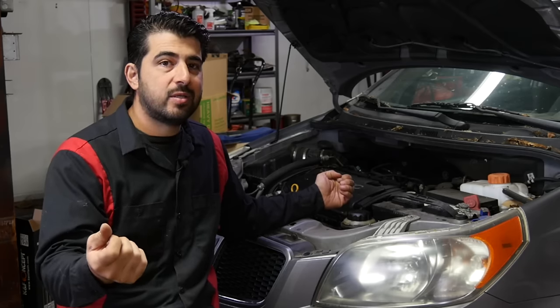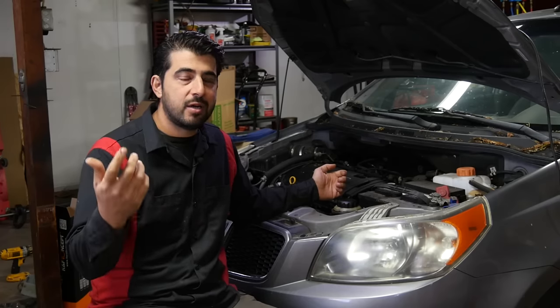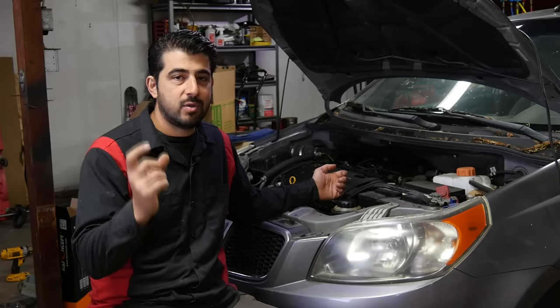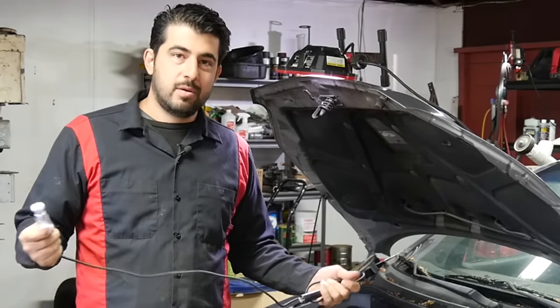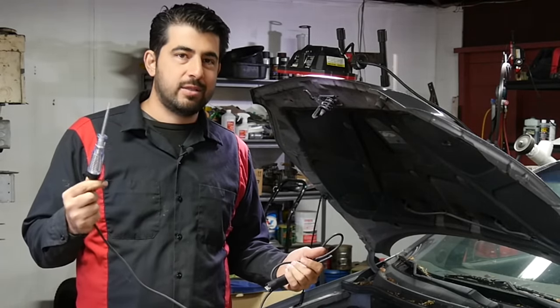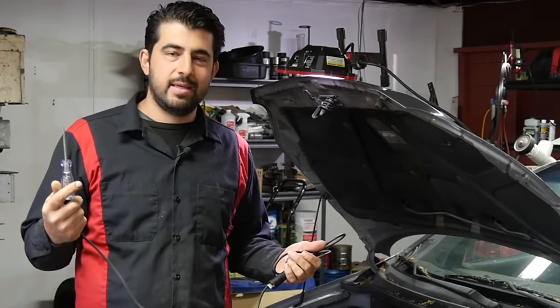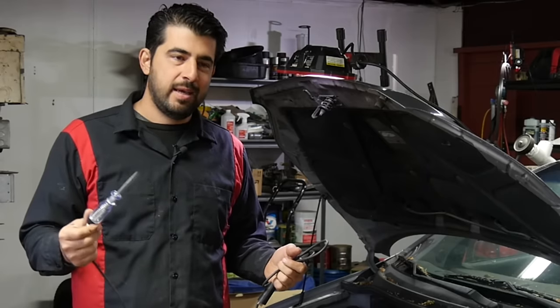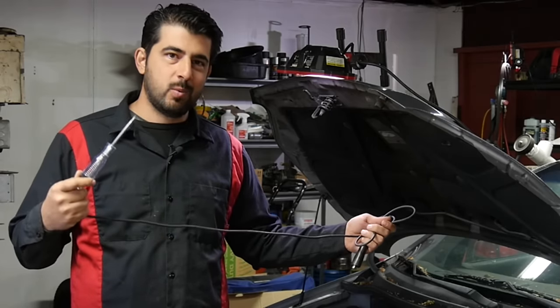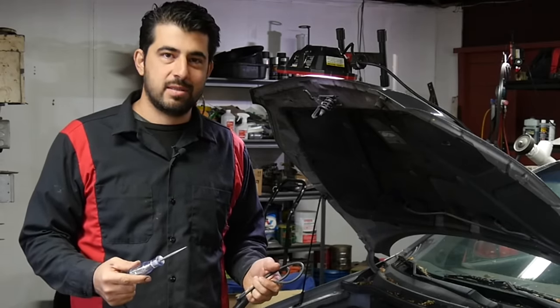And if there is a pathway to ground due to a damaged wire, the amps that can flow through your skin are going to be very limited — but you're not going to know there is a pathway to ground because there's no light bulb inside your test light to illuminate and let you know. So, can you damage your car's PCM using a test light to send voltage up through a signal wire? No — because you're not really technically sending anything up that wire. There's no current flow, no amps flowing through that circuit. You're simply extending the point at which electrical potential difference can be measured, as far as your car's PCM is concerned.